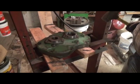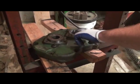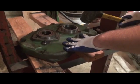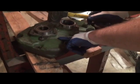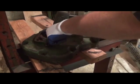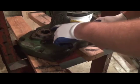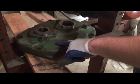Alright, now it's time to press our shafts into the bearing and into the overall power shaft housing cover. So I'm just going to install the ball bearing first, and it's important, most of these ball bearings, depending on if they're originals, were shielded on one side, and the shielded side goes away from the tractor and the open side goes in toward the inside. So we're going to tap that in until it bottoms out.